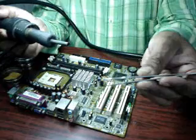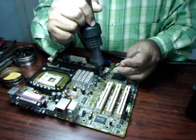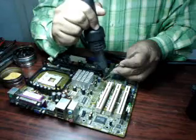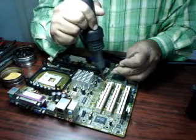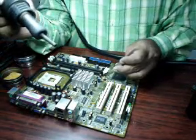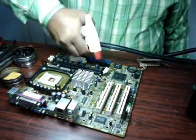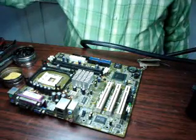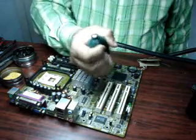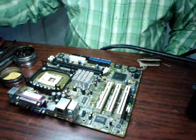This is the transistor I am showing you. Now I am placing it back. Once it is properly placed, remove the heater first, then remove the tweezer. And the next important thing is to spray the alcohol so that the temperature can come down to normal as soon as possible. This is how you remove and replace a component, and this is the use of alcohol.